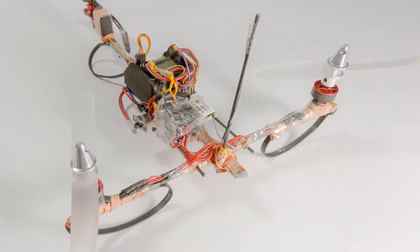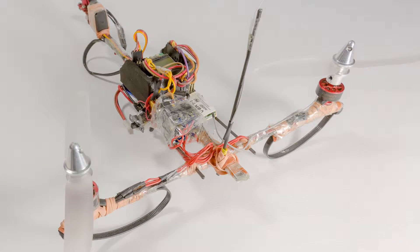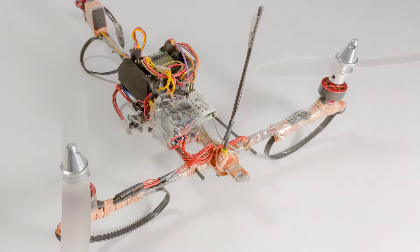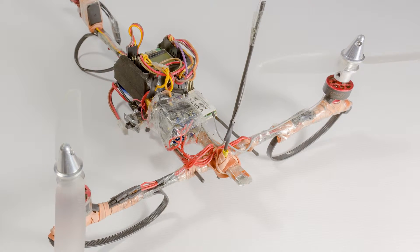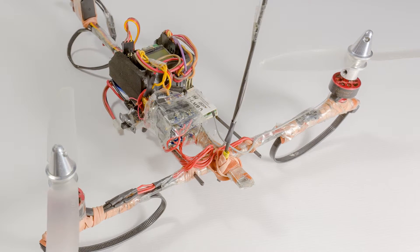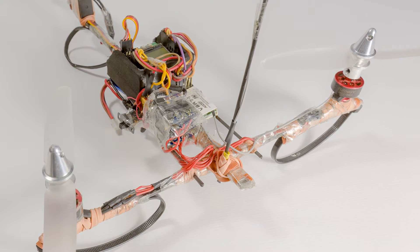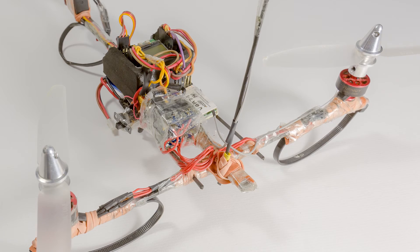After 100-plus flights and 100-plus crashes, I had no serious damages on the carbon fiber frame. I think that the rubber bands make this tricopter way more durable, and they also seem to take out some of the motor vibrations. I will do more experiments with rubber band joints and try to come up with some comparisons to screw joints. Thanks for watching and see you next time.